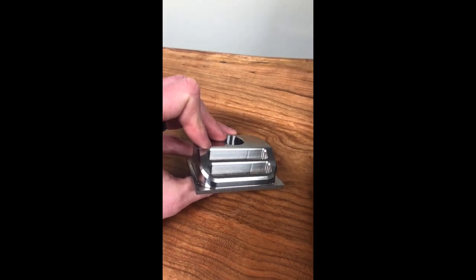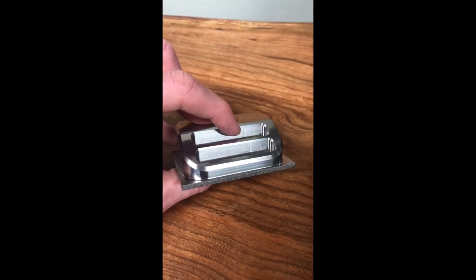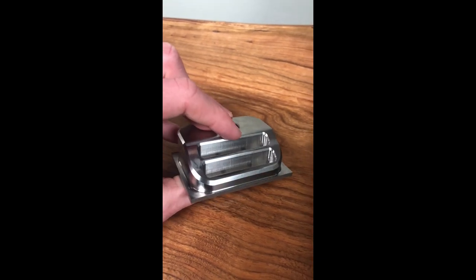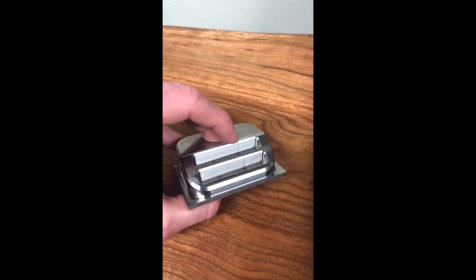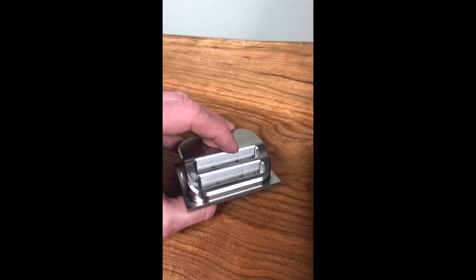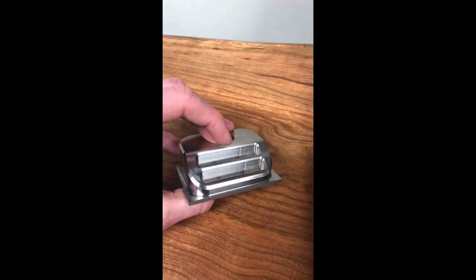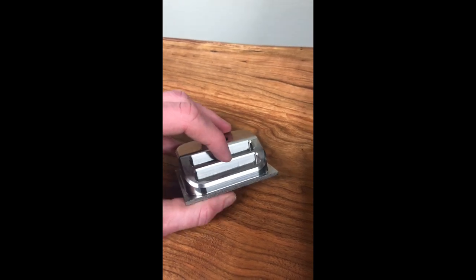The first thing you can see right here — that's my lead-in and lead-out for finishing these pocket walls. You're almost always going to have some sort of little witness mark. It's kind of where the cutter just tends to grab a little bit as it's leading in and out of the cut. What I like to do is, if there's any area on the part that lends itself to hiding that, I try to put my lead-in and lead-out there.